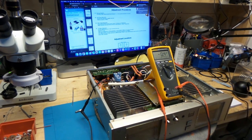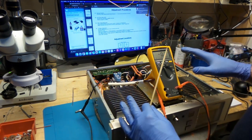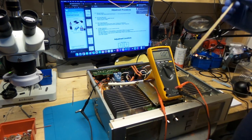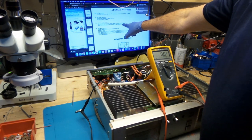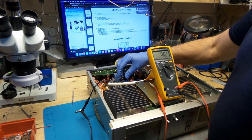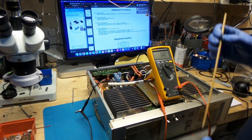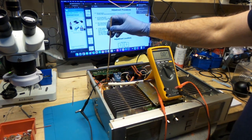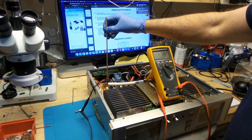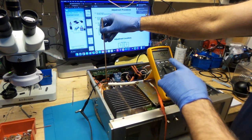Okay, I'm back on with the Luxman. I'm trying to figure out why I'm having an issue setting the bias on the right side. My probes are properly set to the resistor emitter R143B, and that's where it's set. But I'm reading 0 millivolts on this. But I just want you guys to watch this. If I touch this right there, touching it, I'm reading something different.